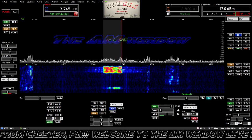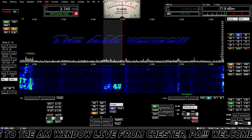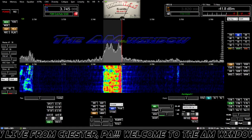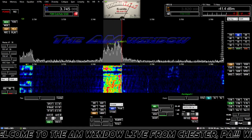It thrashes the hell out of the radio. It really flogs it because it's running full tilt, even though you're not even talking. Oh, well. If you're on VOX, it's not a big deal because your current drops to zero between your words. But if you're on push-to-talk on Class A, it's like a constant carrier the whole time. Oh, I didn't realize that. Just switch your meter to amps and you'll see it right away. Instead of bouncing with your voice, it's up and it stays there. I see that.